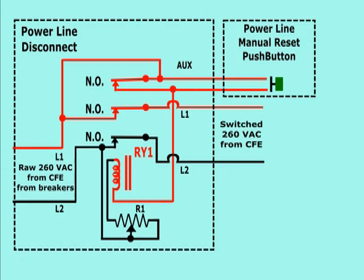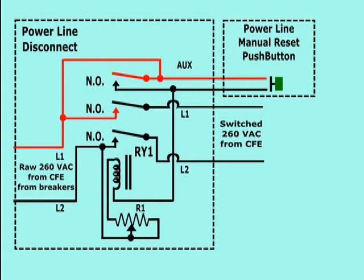Whatever we come up with, we will need a circuit which, in the event of a blackout or a severe drop in line voltage, immediately disconnects the system from the power company, and will not go back to the grid even if the usual voltage comes back. In order to achieve that, we must use a contactor with a contact capacity greater than that of the main breakers, so as to avoid overloading the contactor contacts.